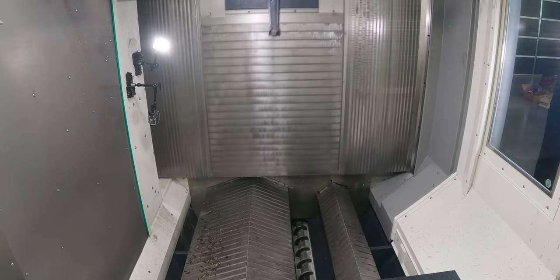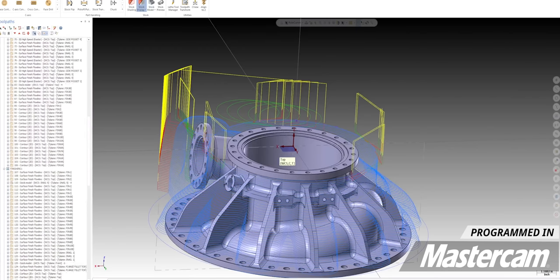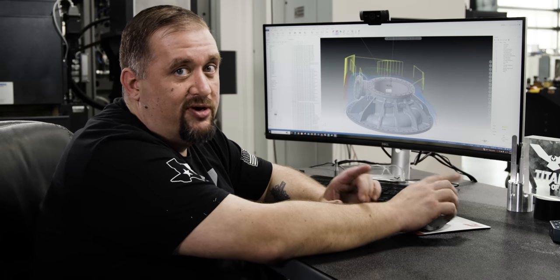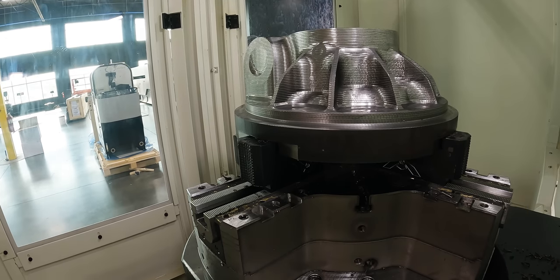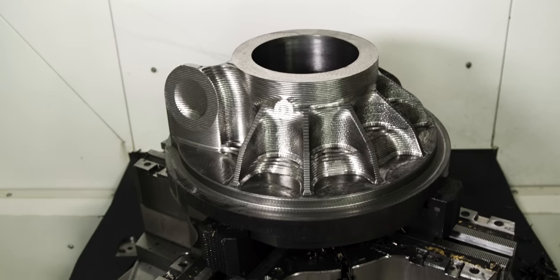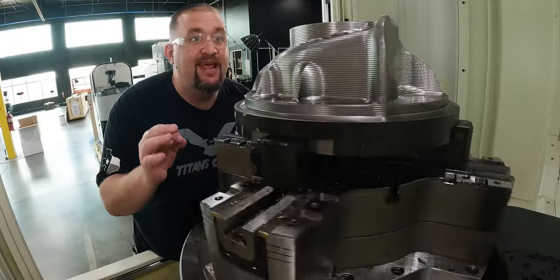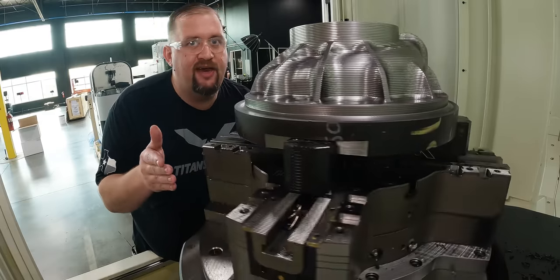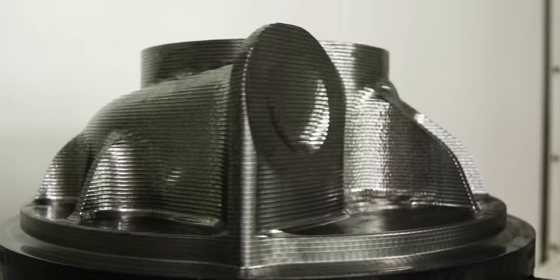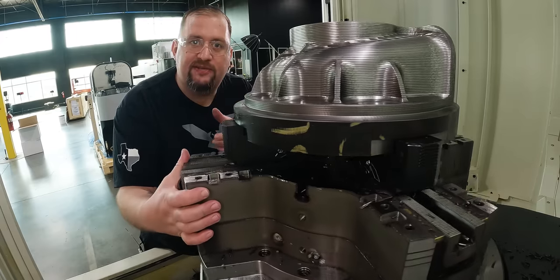I'm only through the semi-finishing of the program so far, but if you take a look at our feature tree we actually have hundreds of tool paths to get through. We got this whole part roughed to this state in about 30 minutes — that's efficient roughing. Now that we have almost all of our three axis stuff done, we're going to get into our three plus two and our full five axis stuff in the next videos. If you see this part in the thumbnail, click and check it out. Please like and subscribe — I'll catch you guys next time.